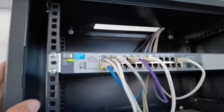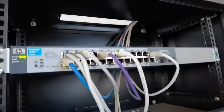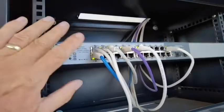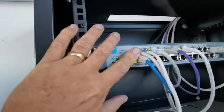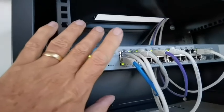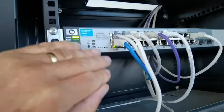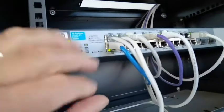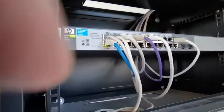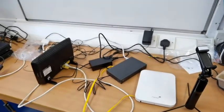Instead of buying an 8, you buy a 12, 24, 48 — whatever you want. And I'll show you a 24-port switch as well. Here's a 24-port switch. You could put a cabinet in your premises somewhere and then you've got 24 devices you can plug in. Don't forget, one will come from your router into here. But keep in mind: the more devices connected to a switch, the more you're going to lose your bandwidth on your broadband connection. So this is the downfall.